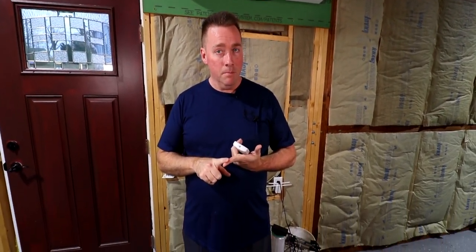The last thing is the dehumidifier part of this. It's a great dehumidifier. So in the summertime, it's going to keep everything from getting moldy. You just got to make 100% sure whenever you hook it up and you run the drain hose out, that it does not get pinched or kinked. If it does, it's going to be putting moisture all in your place. You don't want that. That's pretty much it, guys.